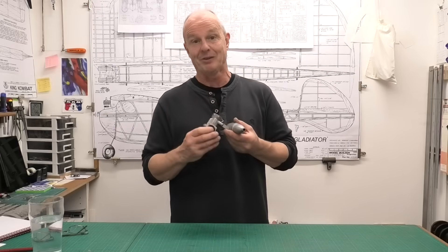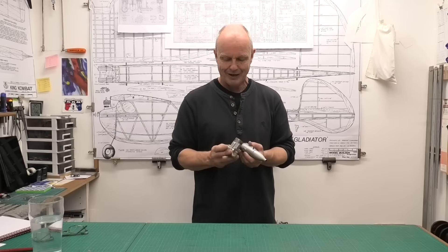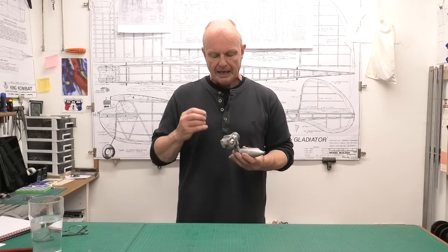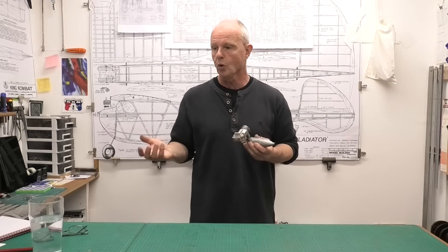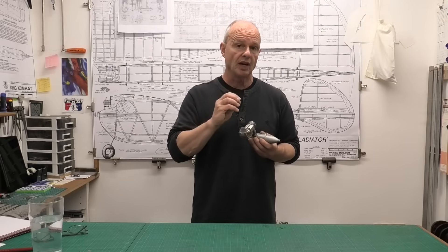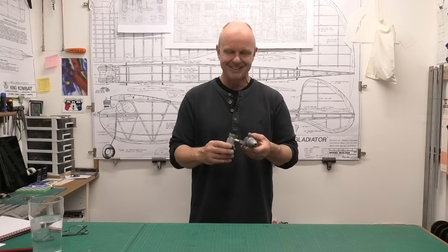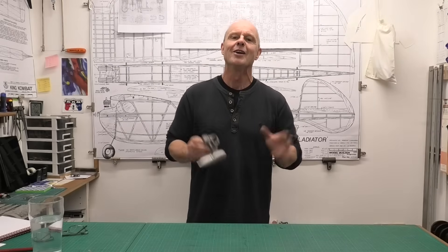The plane - actually it was a flying wing - that this was in when it came down to ground so hard isn't coming back from that crash, so it definitely needs a new model. This is a great technique and I've used it a few times before. It's a relatively easy technique but I would suggest if you want to do it, practice on an old crankcase or an old exhaust manifold first. There are two key things: getting the temperature right - too hot you'll melt it, not hot enough it just won't work - and getting it clean. Really pleased to get this done and I hope you found it interesting and useful. Thanks very much for watching.